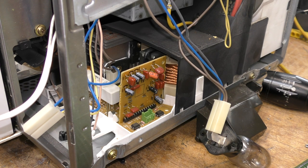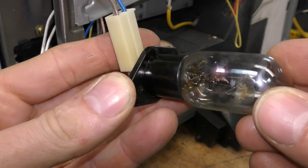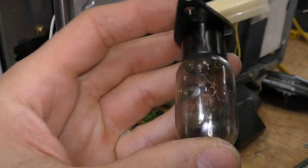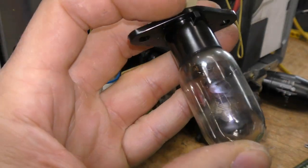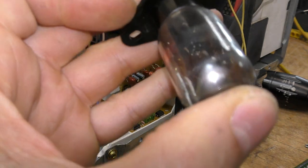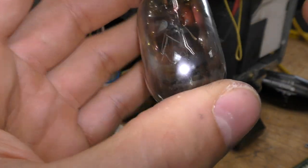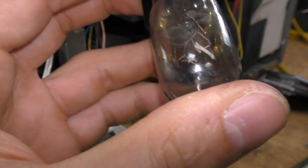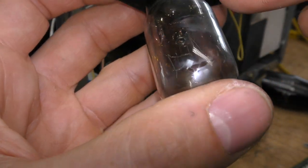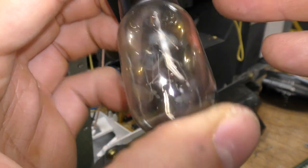So I opened it up and what I found was the bulb had gone. You can actually see there's copper metal deposited on the inside of the bulb. Small bulbs like this quite often actually have vacuum inside rather than being gas-filled, because at very low wattages gas-filled bulbs lose quite a lot in convection. So you can see some sort of copper deposits.